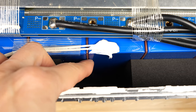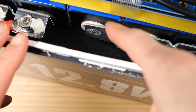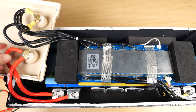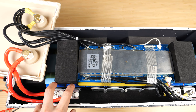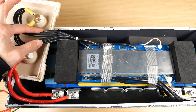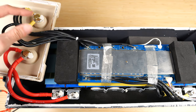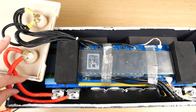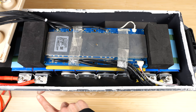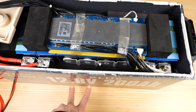On the top side you can't see any writing on the cells, and there's no writing on the sides either. On the top terminal side, there's a black cover on top. There are two large 6-gauge cables connecting to two of the cells — together equivalent to about a 3-gauge wire. There are also six 10-gauge wires, which is equivalent to around 2.3-gauge wire, so a little bit beefier than the 3-gauge side. There are a bunch of terminals on top connected in parallel going down into the cells, and two posts from the first two cells connect to the third and fourth cell with a bus bar.